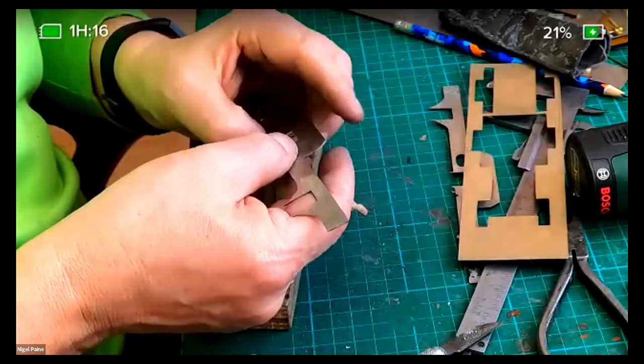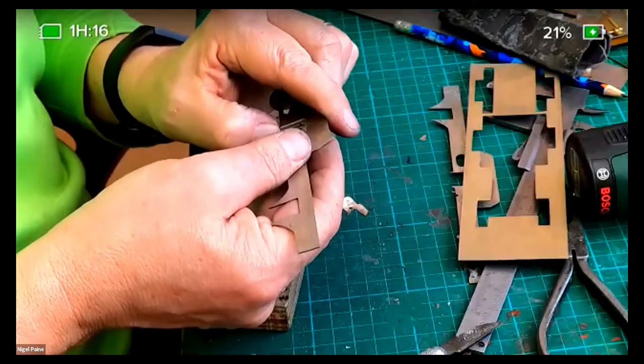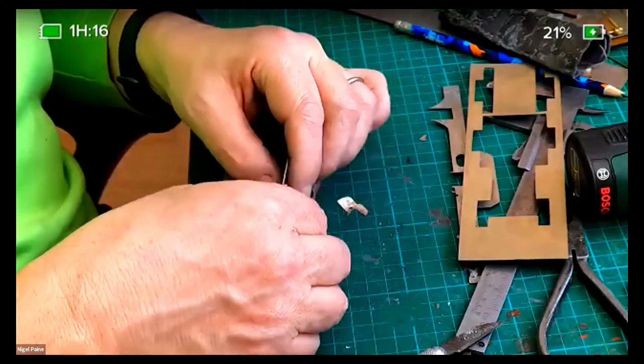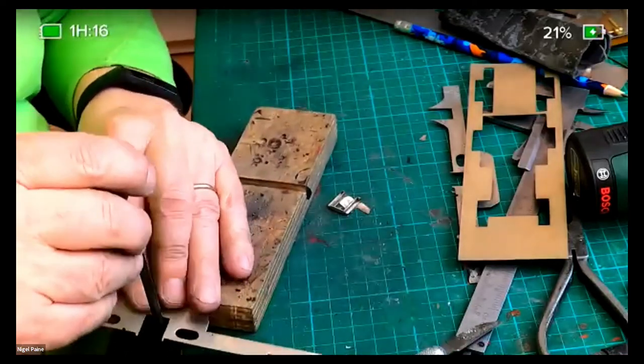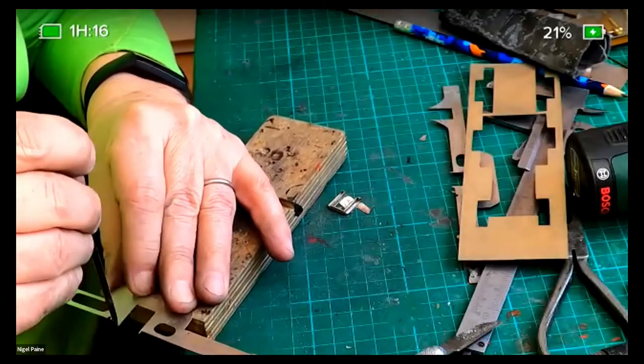It's easier to cut. I think there are different hardnesses of nickel silver, of course, but I think it's easier to cut and it's certainly easier to solder. Nickel silver is a wonderful material. I don't know why people design kits and make them out of etched brass, then etched nickel would be a lot better. Well, I know a bit about nickel silver, Nigel, and the grade normally available to modern makers is 10% nickel, it's a nice color. It's easy to work.